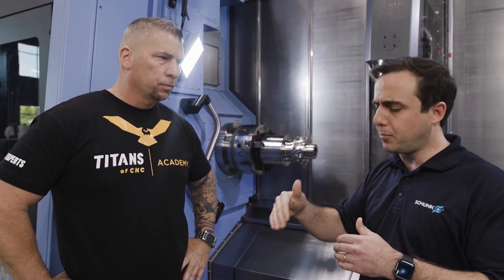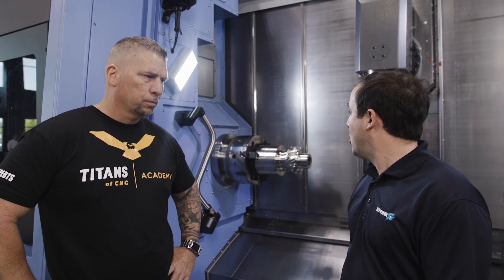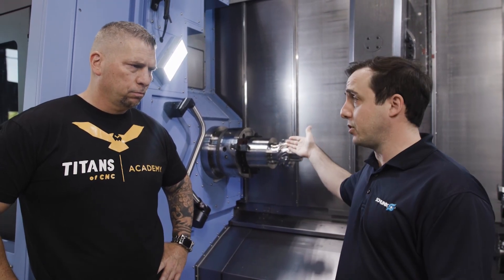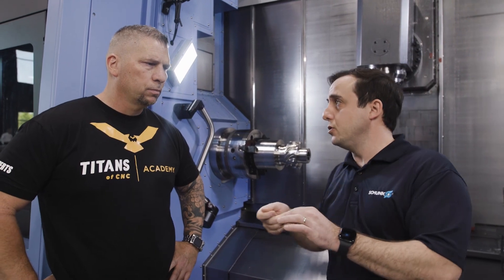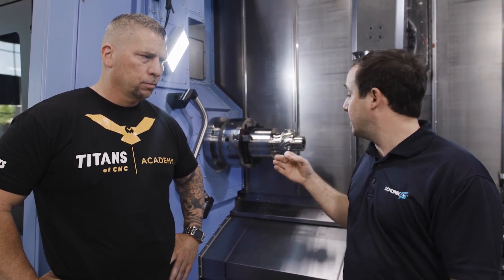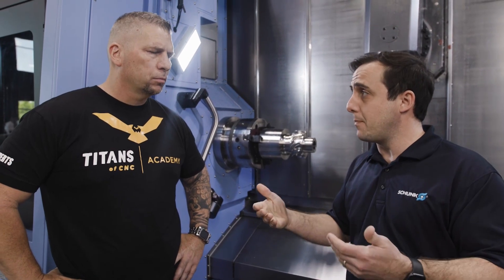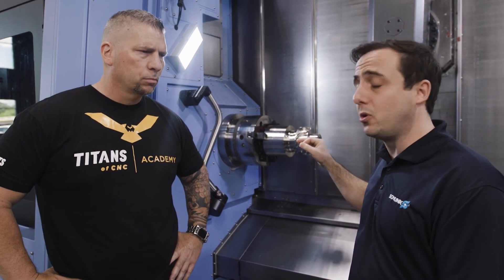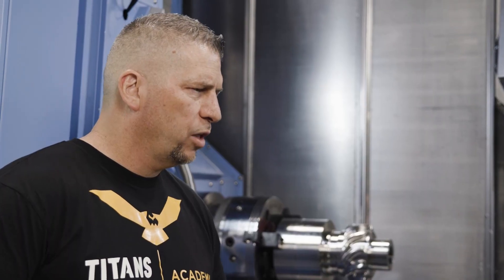The Impact Series claw jaws are perfect for roughing, really getting after the material. But what's cool is this THW Plus chuck — if you want to go from first operation roughing to second operation finishing, you just turn the allen key, slide the jaw out, and slide a new jaw right back in. Because it repeats so precisely, you can even use pre-bored jaws without re-boring them. Just take out the claw jaws and slide the pre-bored soft jaws right back in. The Impact Series claw jaws get incredible material removal rates, and the THW Plus quick jaw change chuck lets you switch between whatever jaws you need.